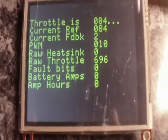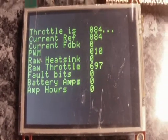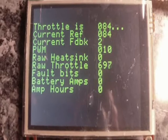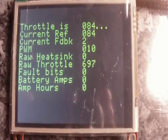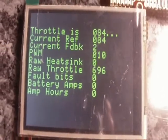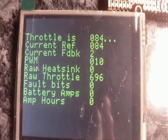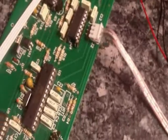We're back again with our display. I made a couple of changes to Greg's code. As we can see, the first change is that the numbers and characters are much bigger on the display. And I have also taken out the part of the code that was causing the screen to flicker — that was because it was essentially clearing the entire screen every time it got a new data frame from the control board.